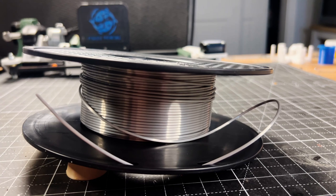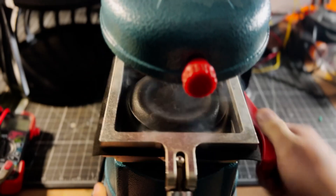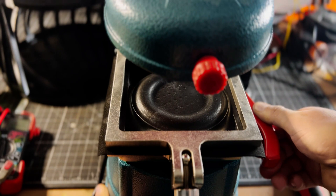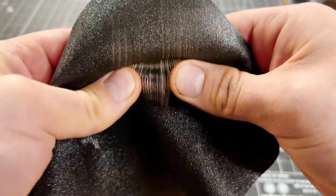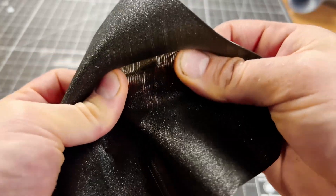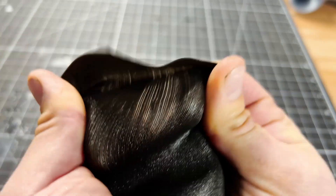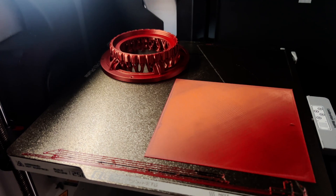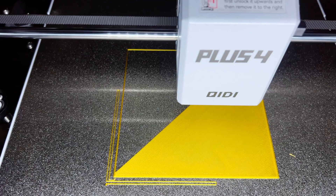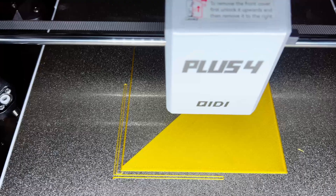I feel this is just to show not everything always works out, but sometimes we just gotta roll with what we have. Now, vacuum forming — another tale of just running with it. I want to take back what I said about all thermoplastics being able to be vacuum-formed. TPU is a special case. I could not get a TPU printed sheet to be airtight enough to vacuum form. I tried on numerous occasions and failed on numerous occasions. I feel an extruded sheet would likely work, but not a printed sheet — at least not one printed at 0.32 or 0.64 millimeters thick.